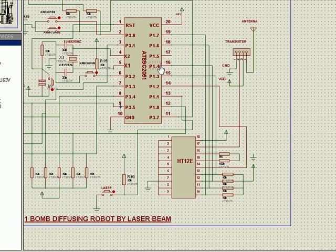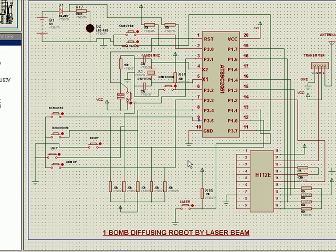from the microcontroller to the encoder, which in turn gives the serial data to the transmitter, which is transmitted and received, and finally the received data appears at the receiver decoder, and that decoded data is fed to the microcontroller for doing the respective work, such as the motor movement, which we have seen using L293D.